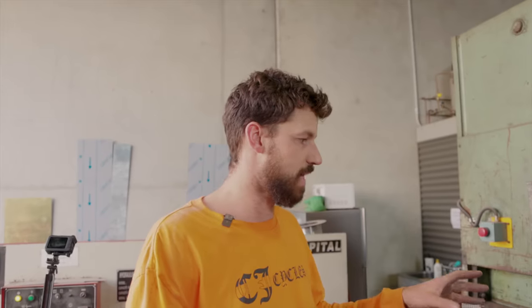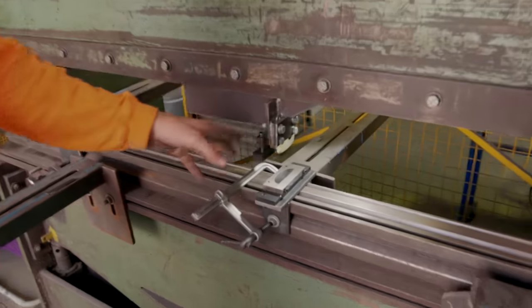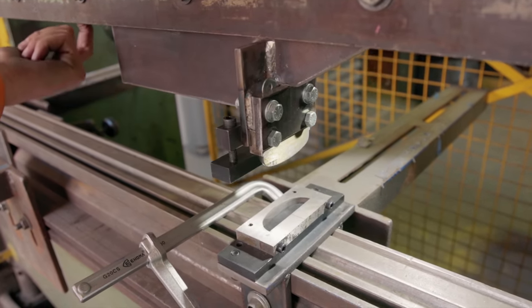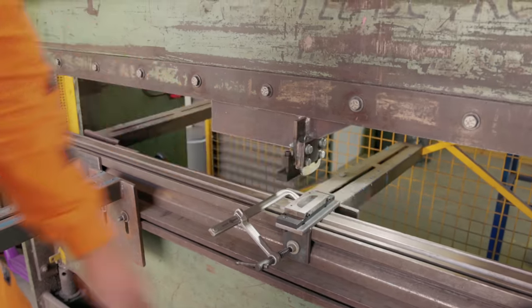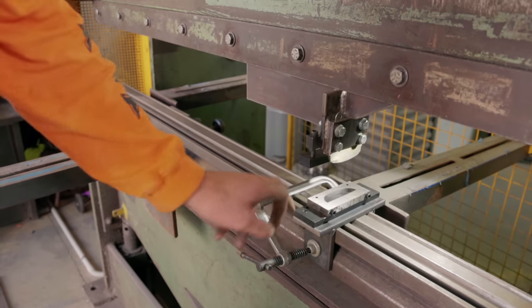Okay, so we've got his massive hydraulic press. This was a quick way of doing some louvers on the race car, because we haven't quite made the louver press itself, but this thing works really well. You've probably seen it in previous videos. If you haven't, I've just used the T-slot that goes up into this pocket here for bending. This is your bending block with various bends on it. And what I did was I welded the actual die to it.